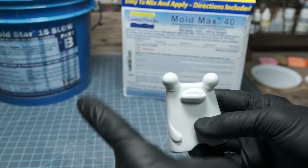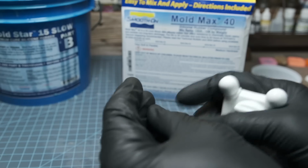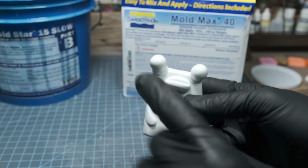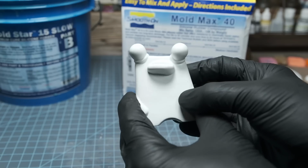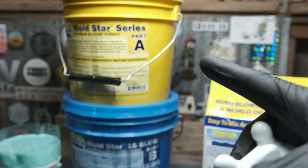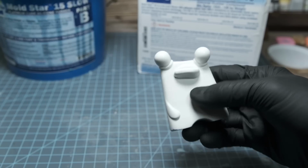You don't want to go too many generations away from something, make a copy of something, make a copy of that and a copy of that. We talked about that briefly before. You would only want to do that one time, and that's your new master copy in plastic resin that you can make out of platinum cured silicone, and it'll last you decades. You know what I'm saying? It'll last you a long time.